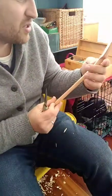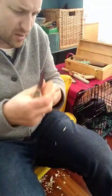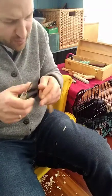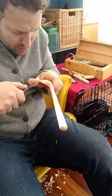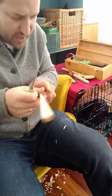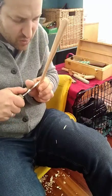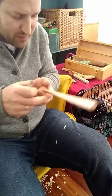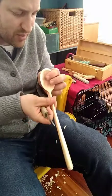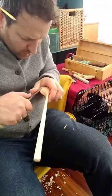I'm just sweetening up the lines on the outside a little bit, finding the back just a touch. I want to do all of this because once I'm doing the bowl, I want to know that whatever depth I achieve is going to work for the finished dimensions of the spoon. I don't want to go too deep and realize the back was thicker than it was going to be. Okay, so now I'm back where I was earlier.